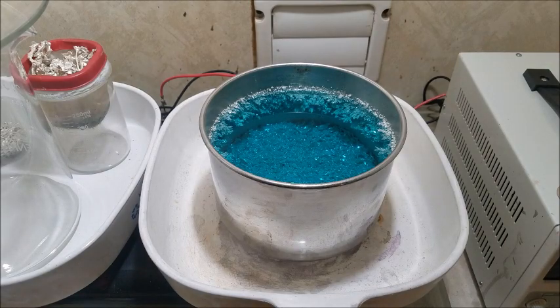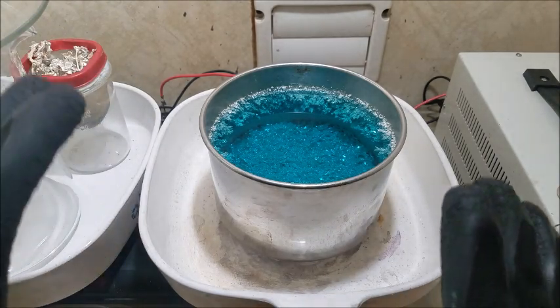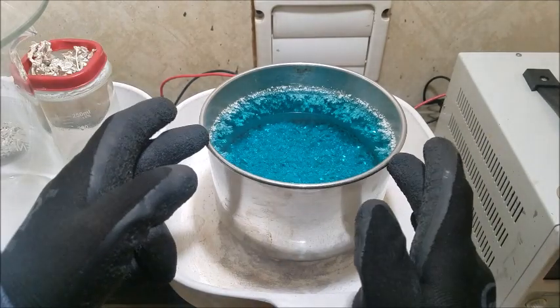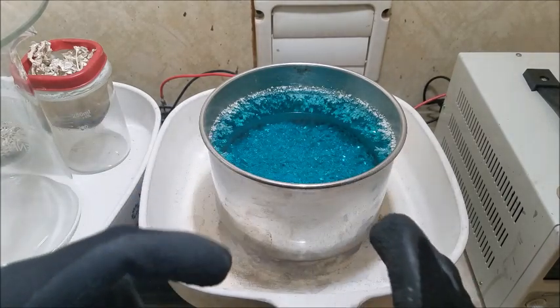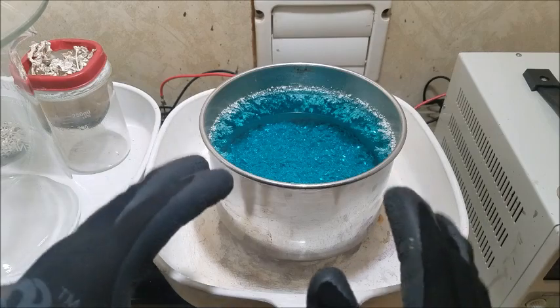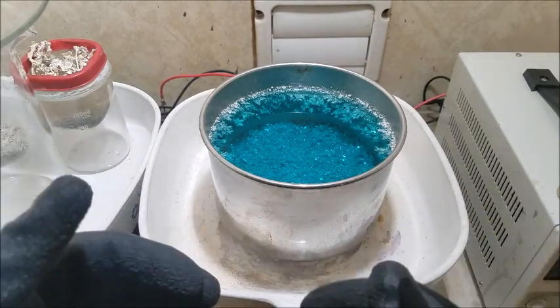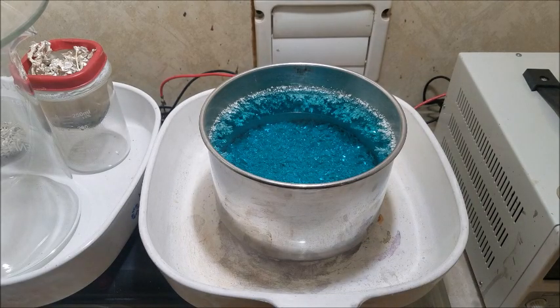I'm just worried that it's gonna start to grow, maybe get wispy, whatever it's gonna do. I think since I'm pushing this electrolyte, I'm gonna harvest the material that we have in here right now. And if at some point I messed up and our solution does become exhausted and it starts to plate out copper, I don't want to wreck the whole batch, so I'm just going to remove this silver, clean it, wash it, and then we'll start fresh. Alright, so let's get to it.